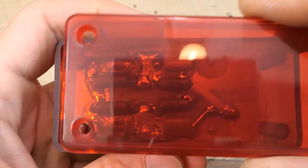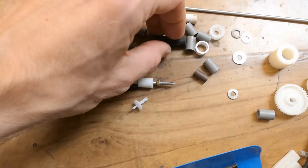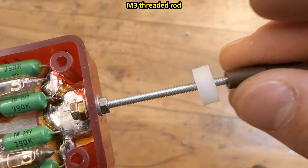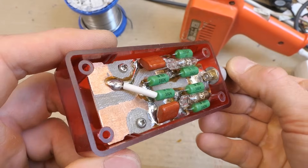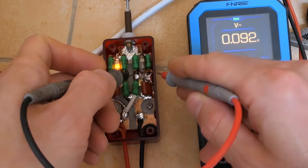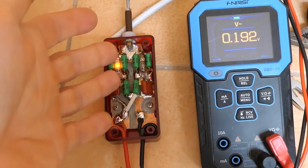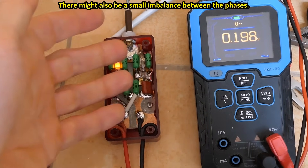The lamps are in place. Because I never throw anything away, let's use some random plastic bits — plastic tubes to insulate the probe tips and a piece of threaded rod. Now just two probes with a cable to finish it, using probes from an old multimeter. Then the cover goes on. On the inactive lamp there is about just 6 V AC — way below the neon lamp threshold of about 40 to 90 volts. Ideally it would be zero, but in reality components have tolerances.